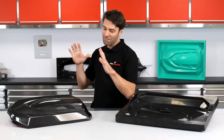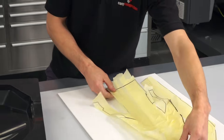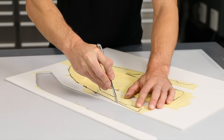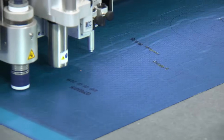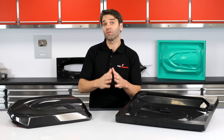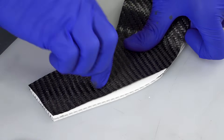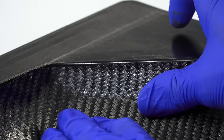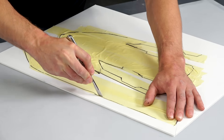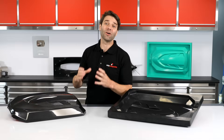So we now have our finished high temperature carbon fibre mould. But we're not quite ready to start producing parts. The first time a part like this is made, a new set of templates are needed to cut out the pieces of prepreg. Getting these absolutely spot on reduces waste and speeds up laminating time later down the line. It is possible to generate templates by unwrapping surfaces from a CAD model, but you will almost always find they need adjusting slightly to get a perfect fit when draping the material in real life. For this engine cover, the templates were produced manually, then test fitted, perfected, and transferred across to plastic in around two hours.